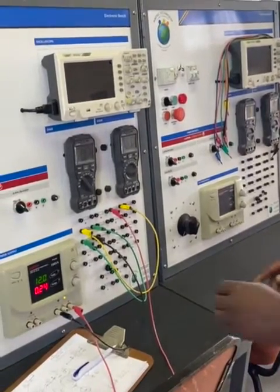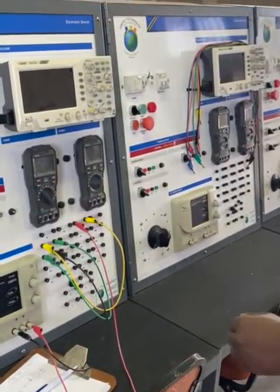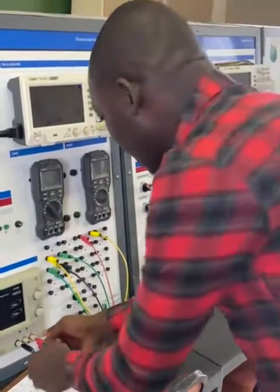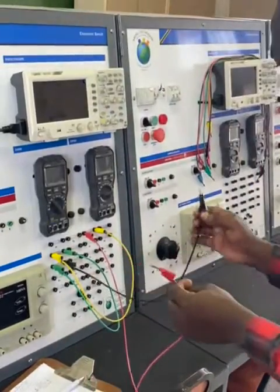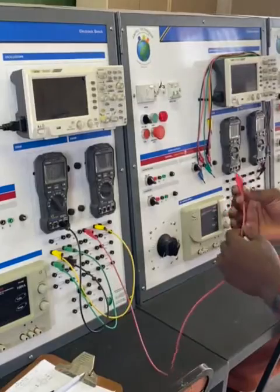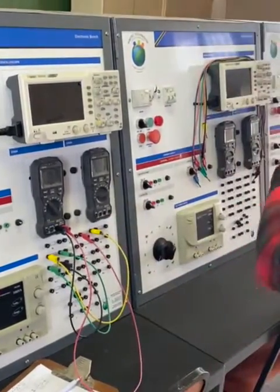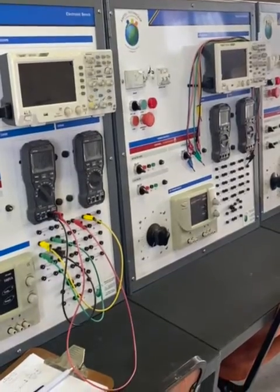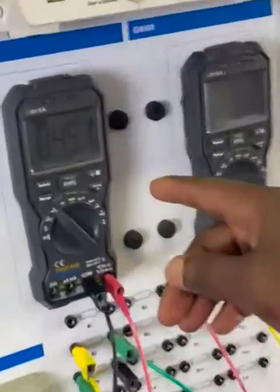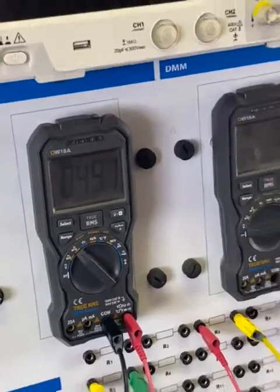For the first parameter, what we want to measure is the total resistance. Don't forget, for resistance we have to switch to the ohm scale. Then we're going to plug our multimeter accordingly. The negative always goes to the common terminal of the multimeter, and the positive goes to the positive terminal. And you will notice here, you will see that we have our total resistance — that's R total.